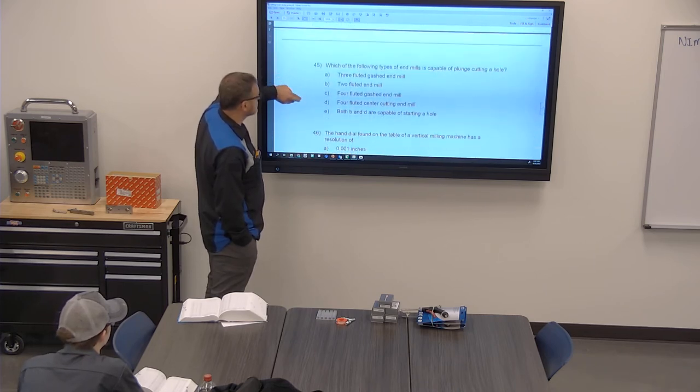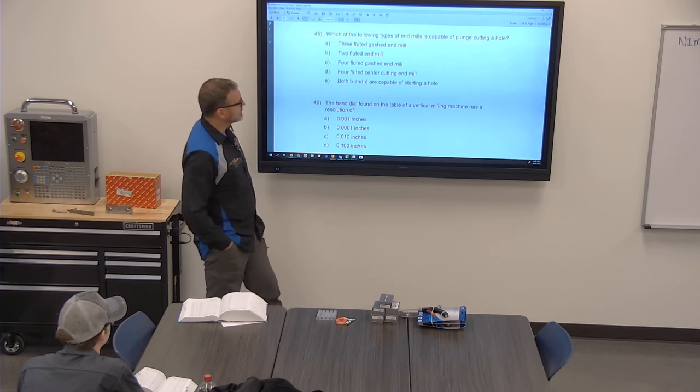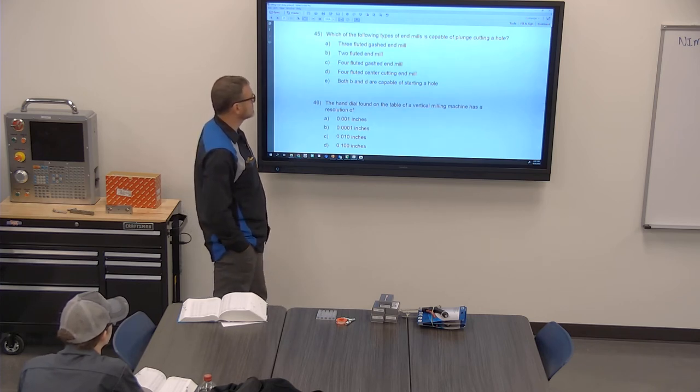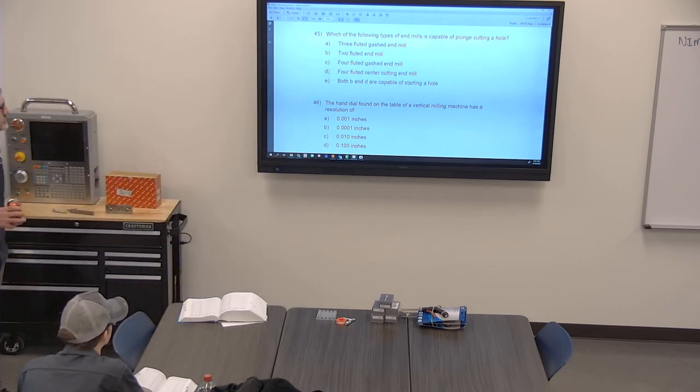End milling operations. Which of the following types of end mills is capable of plunge cutting a hole? Which one? D. Four fluted center cutting. Are you talking about B?